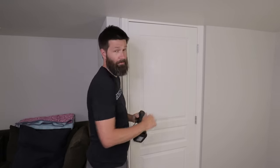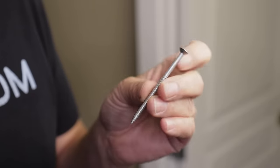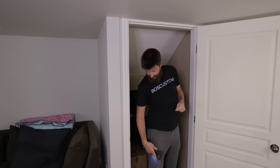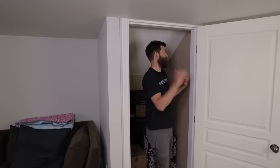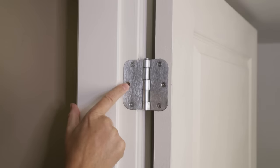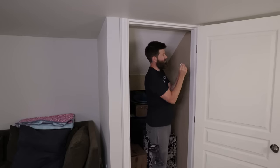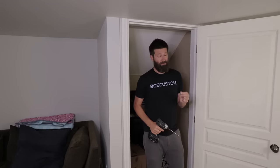This is the magic bullet solution — something that's worked for me at least 30 times over the years. What you want to do to suck that door over and straighten out the gap is take a long screw, like a three-inch or two-and-a-half-inch screw. Match the head size with the screws you already have; pull one out and take it to the hardware store if needed. The theory is to suck the door over by using a longer screw going into the framing. Take out the back screw — the two front screws just go into drywall — and angle it slightly in towards the framing. Don't get carried away putting this screw in, because if you snap the head off the screw, you're kind of screwed.